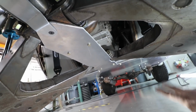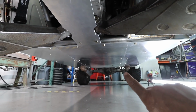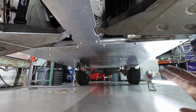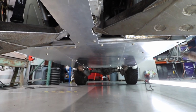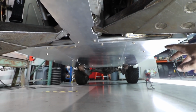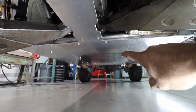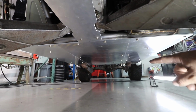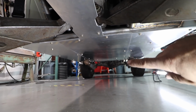If you need to access under the truck, like if you need to get to the trans, guess what? That middle belly pan is going to come off. The other thing with this is it's 3 pieces. It's not one whole one. So those side panels never need to come out unless you're servicing something under there. But we wanted to make the middle one removable. So if you need to get to the trans or the carrier bearing or something with the mufflers, that's all going to be through the middle one. That part is done. Badass, dude.